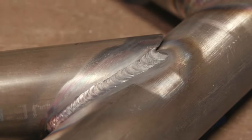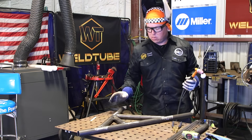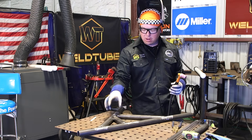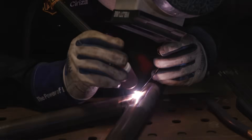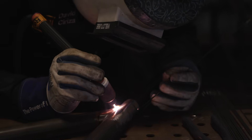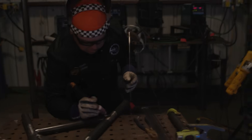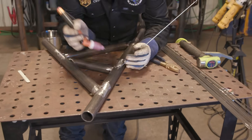Because I am prefabbing on this table, I don't want to continue to weld all in one area at once. I'm going to turn this piece over, weld on the opposite side, and spread the heat out. You don't want to overheat and concentrate it all at once on one weld, especially when you've got a bunch of welds. A piece like this is typically found as an aftermarket suspension component, an aftermarket frame component, or sometimes — like on a repair splice — when a race car has had an accident.